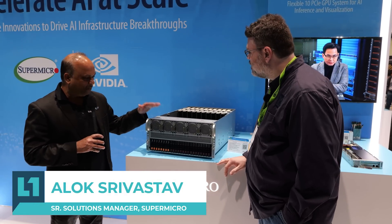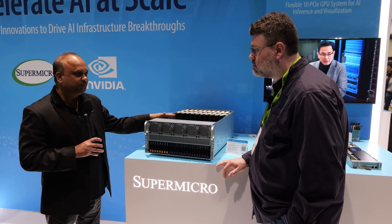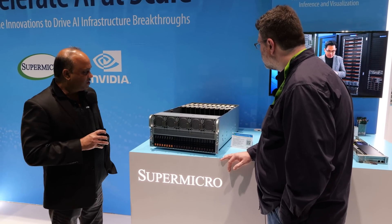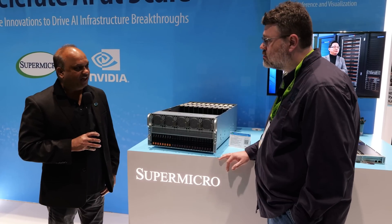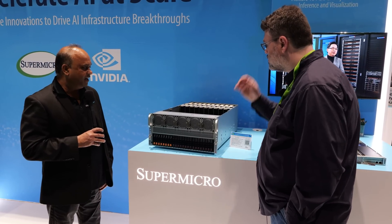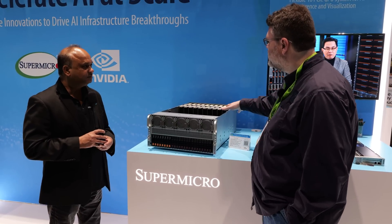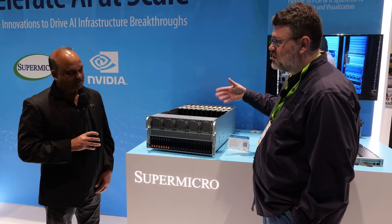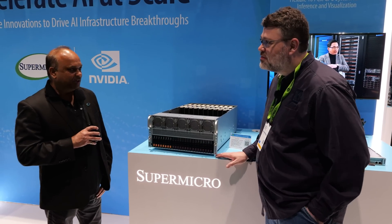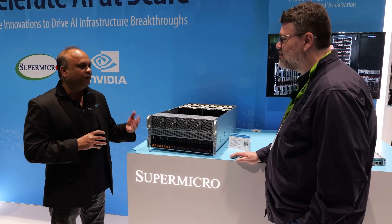This is one of the very powerful systems — what we call our industry workhorse. It can support up to ten double-width GPUs. Right now, as you said, there are eight L40S GPUs here. This system is built exactly according to NVIDIA's guidelines and really supports Omniverse and Metaverse-type applications, and it's a perfect fit if you're looking for best performance per dollar. For the multi-GPU interface, it's using PCIe as its crossbar to support scaling. It's not quite as good as NVLink, but it still gets the job done for a ton of customers — because not all customers are looking for sheer performance. Most are looking for best performance per dollar.